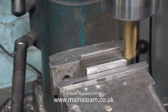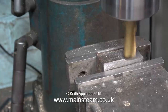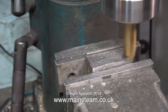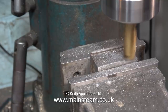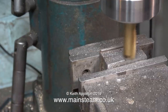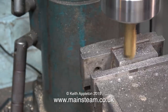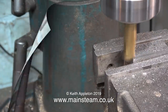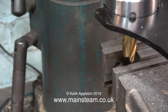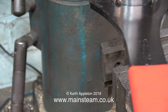Time to do some serious milling. This is an old cast iron axle box I made for a locomotive many years ago — I got the dimensions wrong — and it seemed like a good idea to use it to test the heavy duty capability of the milling cutters. And immediately a problem shows up. It starts off okay, but as I traverse the work the cut gets shallower and shallower, as the milling cutter is pushed up into the collet because I cannot tighten it enough. I would never use a milling cutter of this diameter in my drill chuck — I would use my Clarkson R8 taper chuck for this. The Clarkson chuck uses milling cutters that are threaded at the end and screw into the collets, so they cannot fall out and cannot move upward when taking a heavy cut. That's the Clarkson design — it's designed to be just a milling chuck, whereas these collets are multi-purpose.